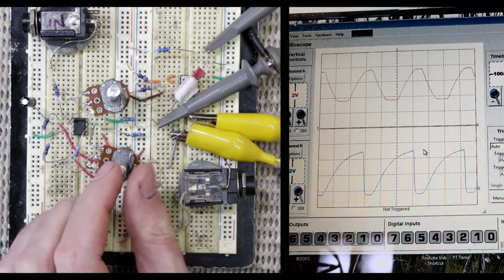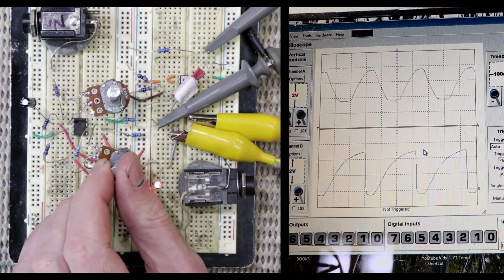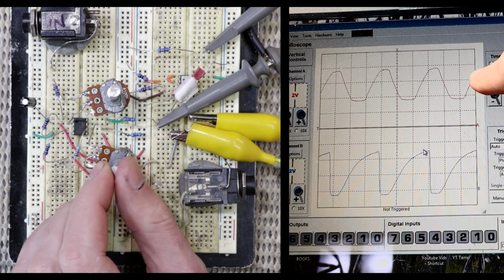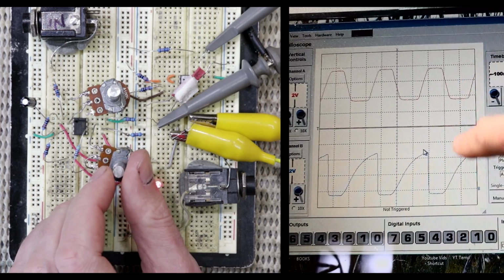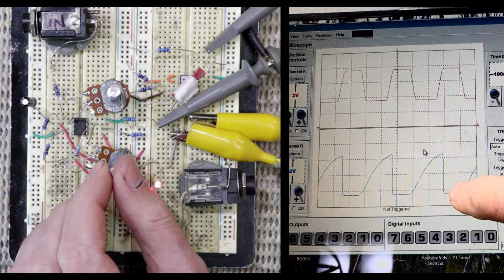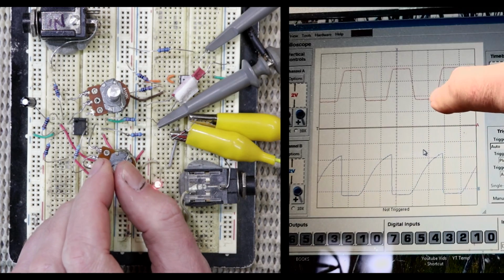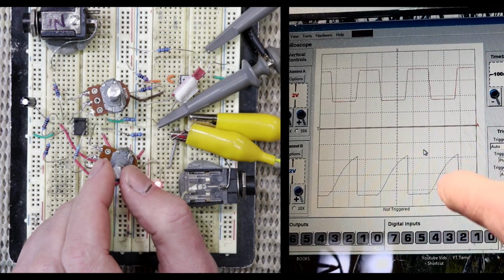So now if I turn up the control, that wave control, you'll see the wave get more and more clipped, and you'll see these sort of silent gaps get further and further apart. And if I crank it all the way up, again, our waveform is very nearly a square wave, and this will give us quite a choppy sort of sound. I think it'll be pretty cool.